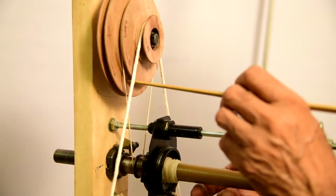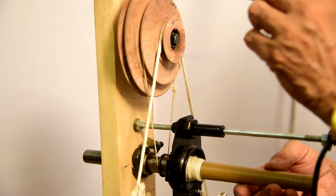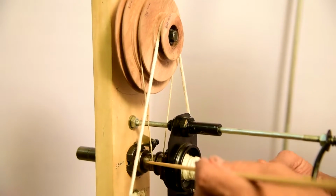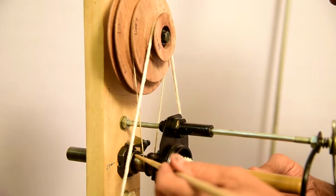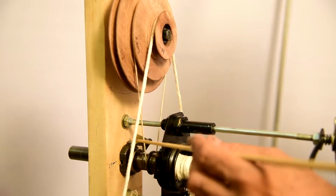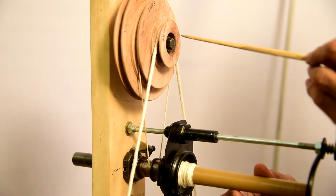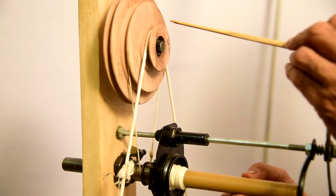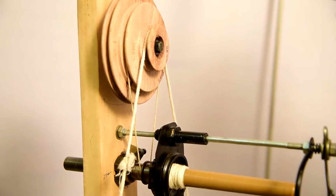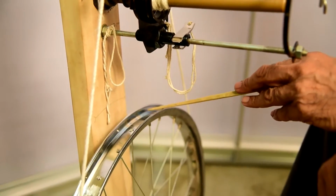On the other hand, the 126 mm diameter step pulley produces better warp yarn in this device. So at the same pedal speed, both warp and weft yarn can be produced, considering the pedal movement is 50 times in a minute.